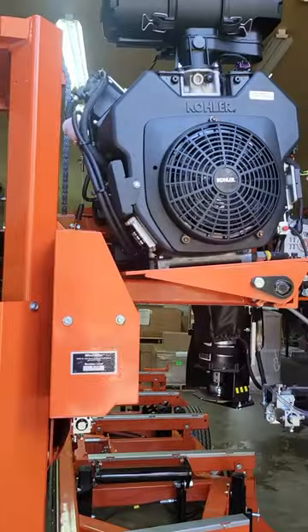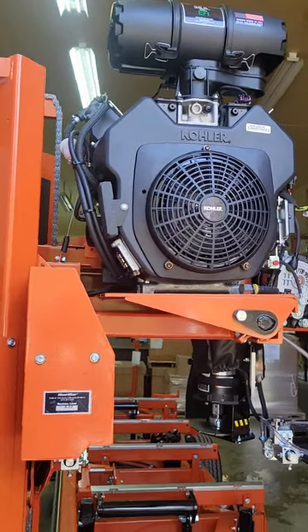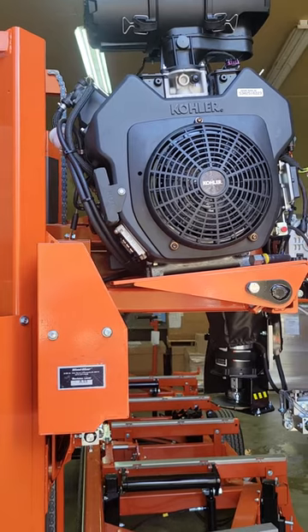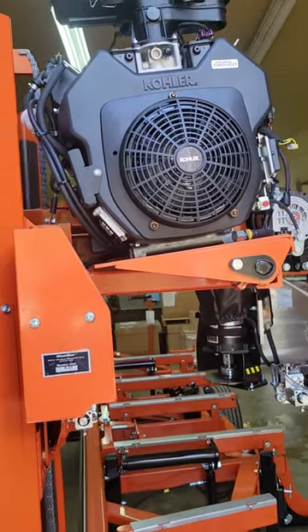Then we can already see the engine is already further over. I'll hit the auto clutch — see now she's going to torque way over. And when it's coming down it has way more clearance for that belt to not drag on top of your pulley. Hope this helps.